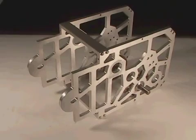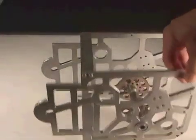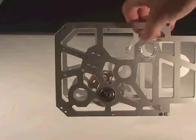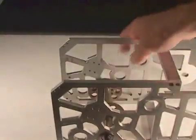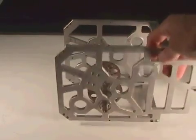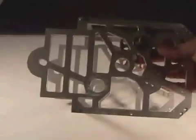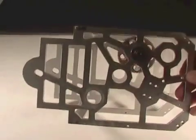Let's take a look at some of the parts you can make on one of these CNC milling machines. This is a prototype gearbox made for the First Robotics Competition a few years ago. These two identical plates hold circular cutouts created to hold ball bearings, through which shafts would go, with gears mounted on the shafts. The gearbox had the ability to shift gears, with a wheel mounted in one section. In terms of machining, it's a plate with a lot of hollowed out sections — the kinds of things you'll learn to program using the CNC milling machine.